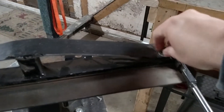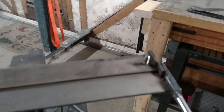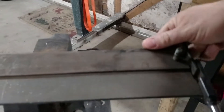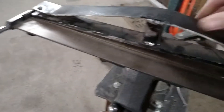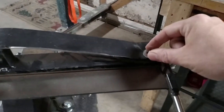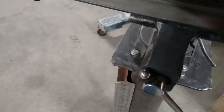What I did is I installed these. I took the wing nuts off — I needed them on another project. I drilled this side and this side, then welded a nut from the bottom so only the thread sticks through. This is not actually attached to that; you've got a little bit of a gap and it tightens it down. So you don't need C-clamps anymore — you just put your sheet metal in, you've got a gap underneath, and it'll bend sheet metal.